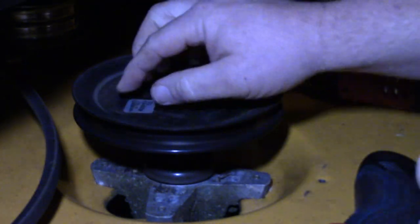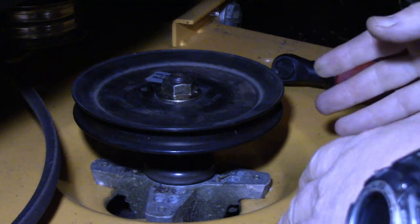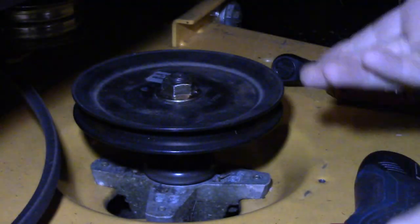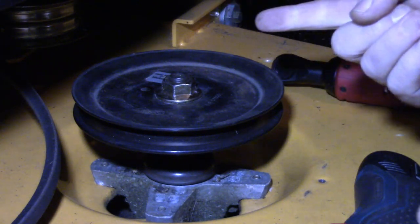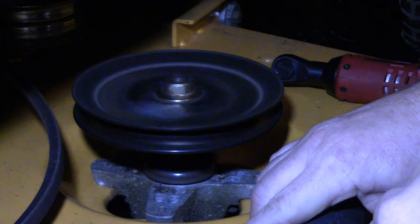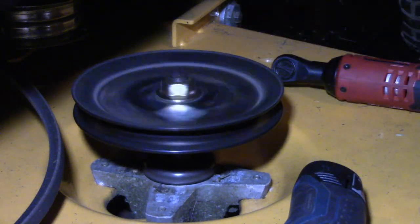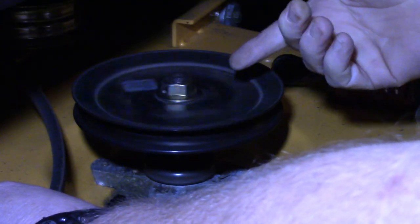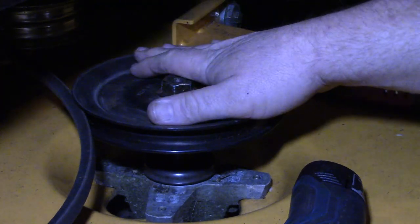There is no damage to the blades, no damage to the head. The blades are actually the second set that have been on here. Now I get to replace this spindle and its twin on the other side. The problem I was noticing when mowing was a chatter, kind of an out-of-round vibration. Sure enough, that's why it's warped — and this is a factory belt, nothing out of the ordinary, but you can see how oblong it is.